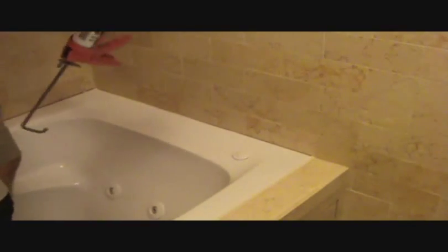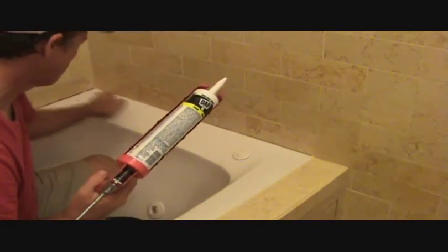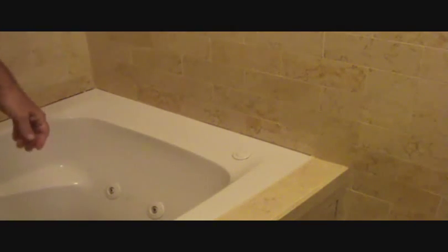I use my finger, get it moist, and wipe it off that way. I'll show you. The key is to have a small tip on here, and I should make sure that's all nicely cleaned and dry. I've got a little bit of grout overage right there so I better clean that off and check around this tub to make sure it's all ready. You don't want to caulk over imperfections like that. Let's get her clean first.